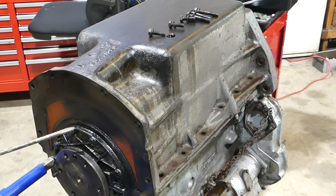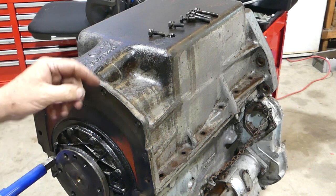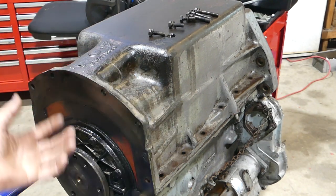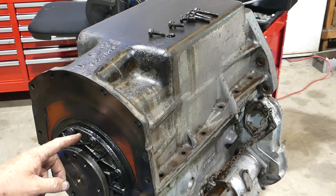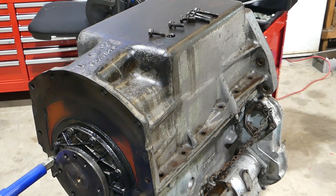We don't need to deal with anything at the back here — it'll just come off. If you can imagine the tractor's still together in one piece and you have the backing plate here, you could undo these big bolts and drop the sump down without actually splitting the tractor. So there's no need to touch these fellas — that should just come straight off.